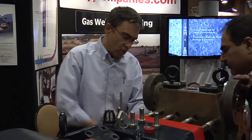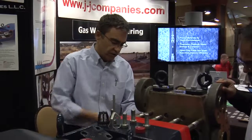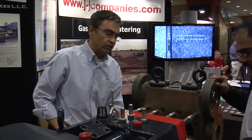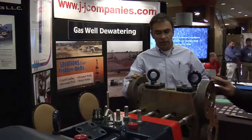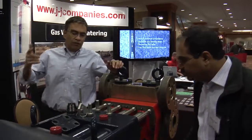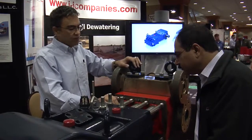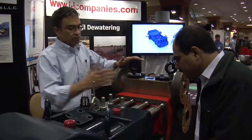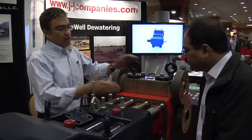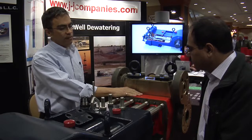To get in the back and check the operation behind the diaphragm — it's a robust and simple design — these two bolts would need to be loosened and removed. From here you can see the cylinders: ductile iron Durabar-type cylinders. We have two-way checks here, so if oil gets foamed and there's entrained air, the air automatically vents out, and once you get viscous oil, the check closes. These hold up against whatever pressure is behind the diaphragm.